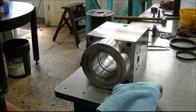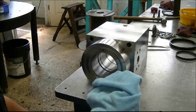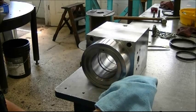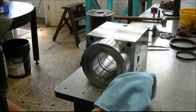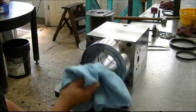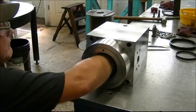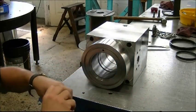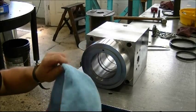Greg will be using a microfiber towel with either xylene or acetone to clean all grooves out. Ensure that the seal grooves are cleaned thoroughly — you may want to use a tool to get deep into the groove and clean the seal grooves out adequately before installation.